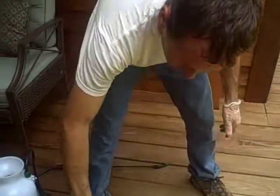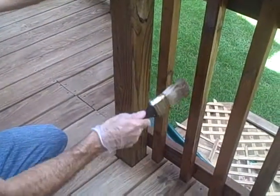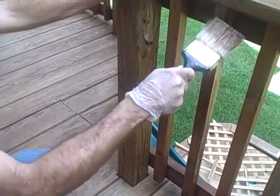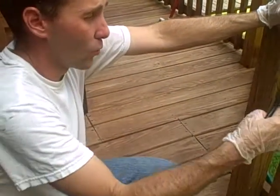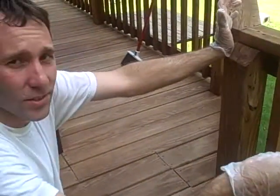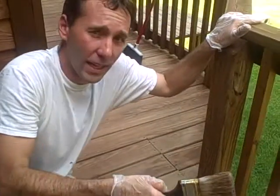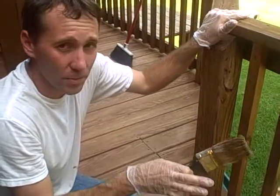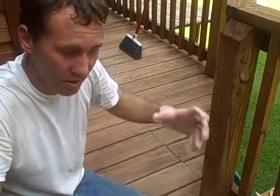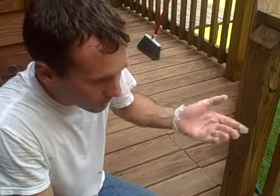The easiest way to handle balusters is just dip your brush and brush it on. They're going to be a lot wetter because the sides will be dripping with stain. But unlike paint, you don't have to worry about runs, brush marks, or anything like that — this is oil, essentially. The stain doesn't show brush marks. The only way you can really mess it up is by not putting enough on. You put it on the deck until the deck is no longer soaking it up immediately. You don't want it puddled up everywhere, although you're going to have some puddles.